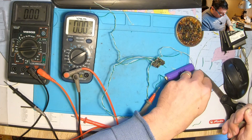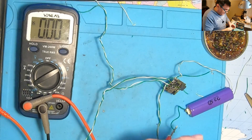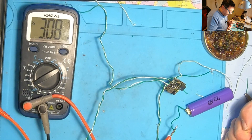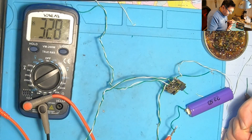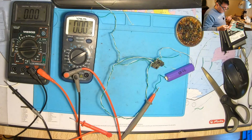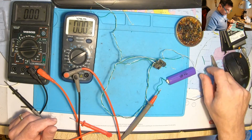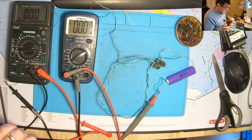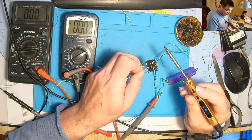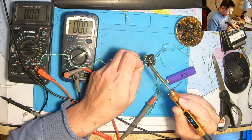4 amps — I can feel the smell already. Let's make the wire longer for higher resistance. It's still burning — 3.28 amps. This one is hot too. So probably the diode inside is doing the job. Maybe a 0.5 amp fuse is a good idea. But now the question is: is it still alive? We did see 4 amps, but I can say I played it safe.